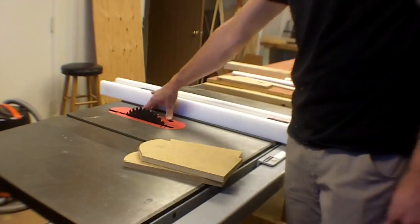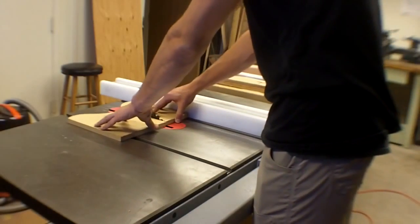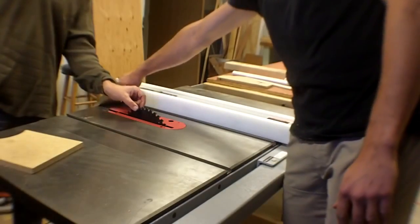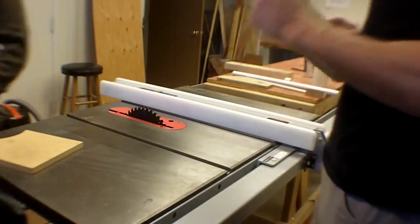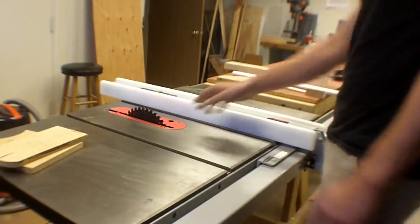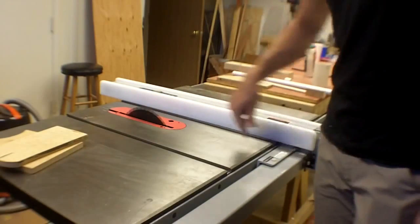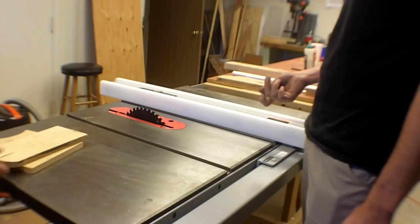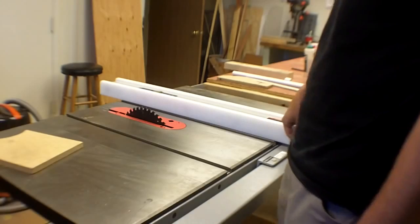You can't stop paying attention once the cut is finished. Separate the cut piece to the side and push the work piece past the blade. The saw basically eats the width of the carbide tips out of the material — table saw blades are standardized to an eighth of an inch kerf, which is the dimension of the width of the cut. This saw makes very nice, finished-quality cuts.